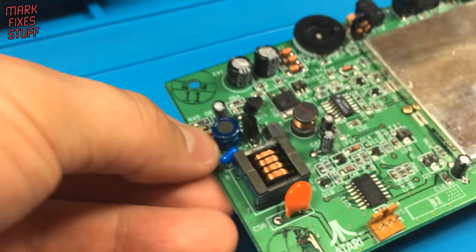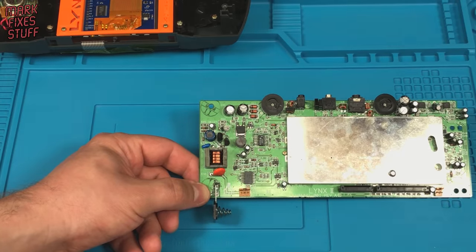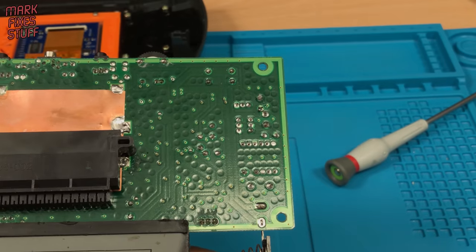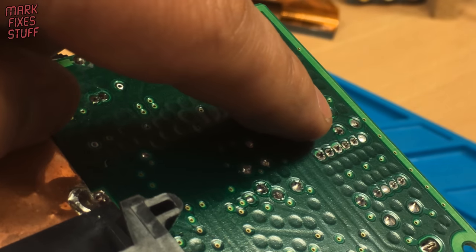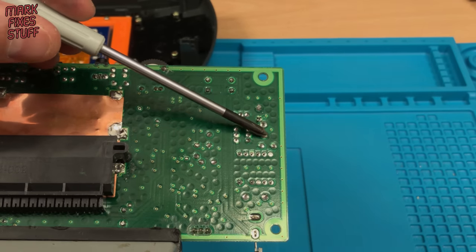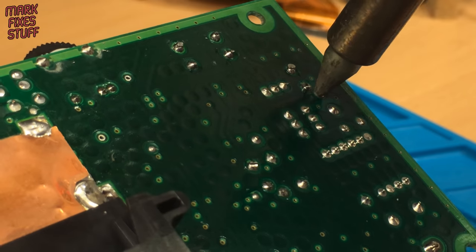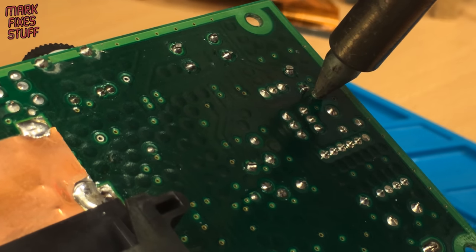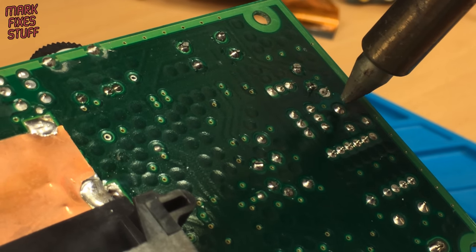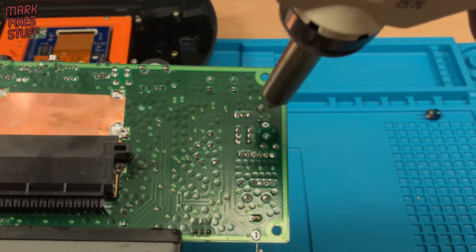This Lynx has been recapped and the power components have already been upgraded. All we need to do is remove this inductor at L17 — see my previous video for power stage upgrading details. The solder points you need are here. This is an easy enough job with a soldering iron, but I'll be using my desoldering station to make lighter work of the task. The inductor simply dropped out.